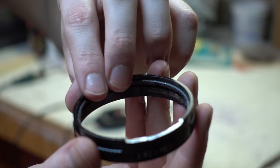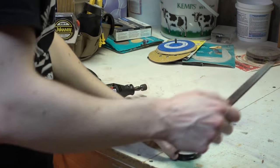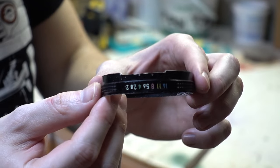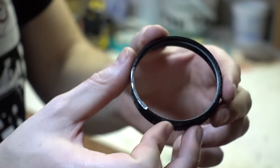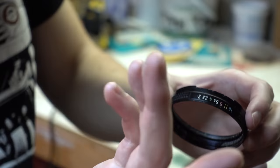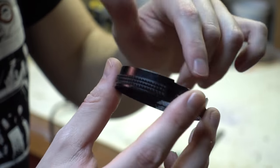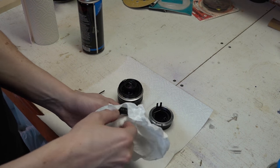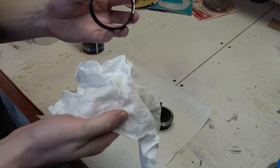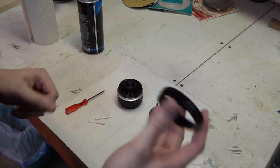I'm going to go back over with the file - the side of the file to make it nice and even. There are little metal bits all in there and I can feel them on my hand and hitting my face. So back to the file. You can see the little notch that's been cut out but there are little metal bits all over the aperture ring, so I'm going to wash it with soap and water, take a paper towel and rub the inside, rinse it off, and rub it again to make sure all the little metal bits are gone. Everything is laid out to reassemble the lens - I'm going to make sure it's completely dry before reassembling. I'll wipe it clean and take some compressed air and blow it.